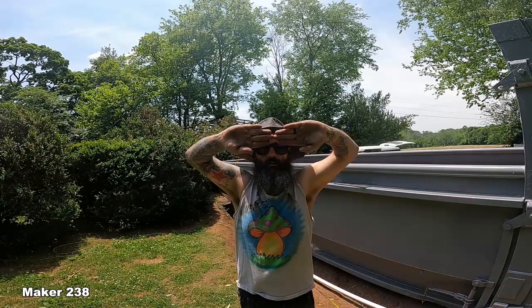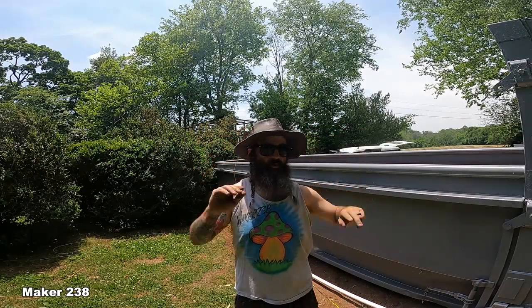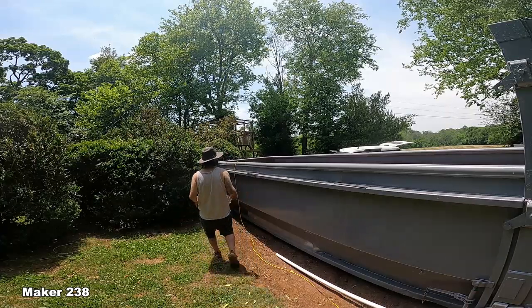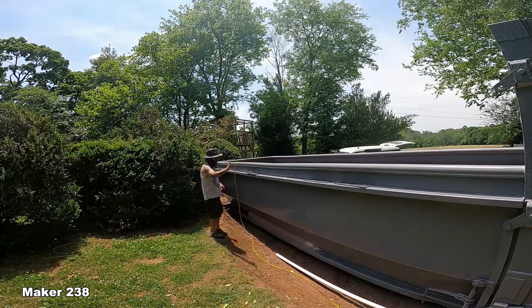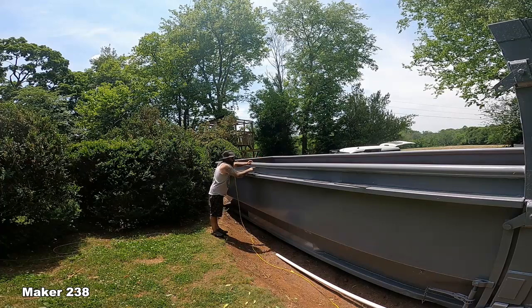So you've got a long piece all the way down. Those side pieces will come down and connect. I'll make some plates to put those on right there. Weld them to the ends, or weld it to the plate, and then put the bolt through the plates.